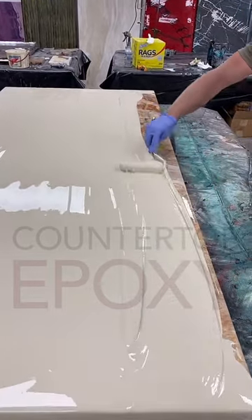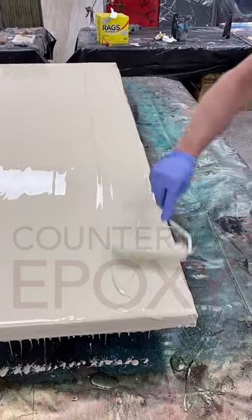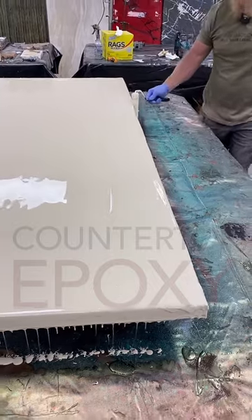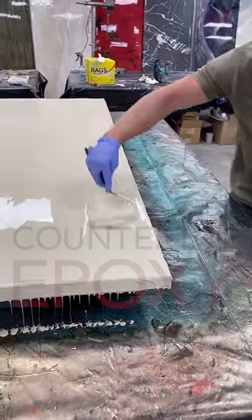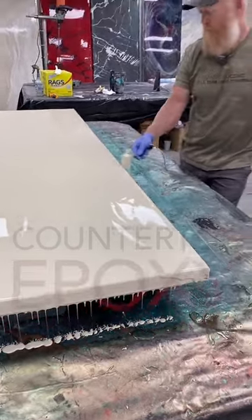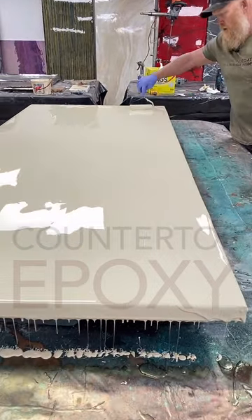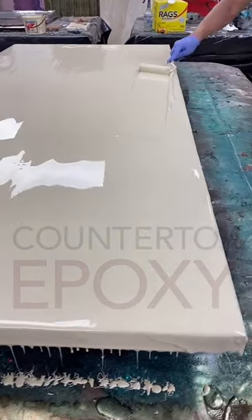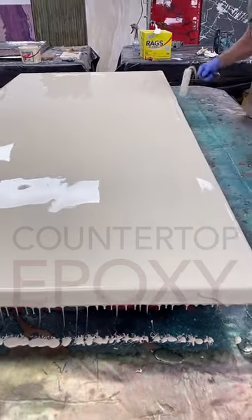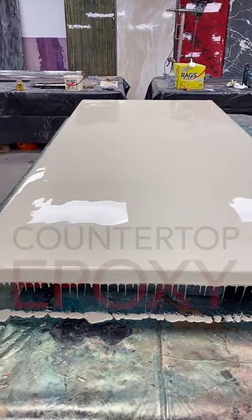How do you work with hot pans? Not as good as any other countertop — 500 degree temperature resistant to incidental heat contact. I wouldn't just set hot pans on it on purpose, but if you accidentally set boiling water on it, that's 212 degrees Fahrenheit at sea level, so 500 is double that. Zero fumes in this product, and this is unique even for products advertised as zero fumes. This is Countertop's Platinum brand and Diamond Coats Black Label — a very healthy, non-hazardous resin. We get clearer, harder, more beautiful top coats out of it.